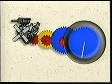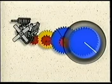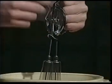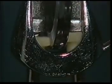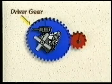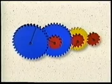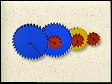In any gear train, the speed of rotation is reduced by the gear ratio and the torque is multiplied by the gear ratio — the two are always inversely related. If for some application such as an egg beater you needed very high speed with low torque, you could simply reverse the gear train and make the large gear your driver. Attaching the motor to the large blue gear makes it the driver, and the small red gear becomes the driven gear, rotating three times faster. By adding more compound gear pairs, even higher speeds can be attained.